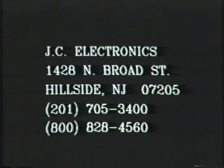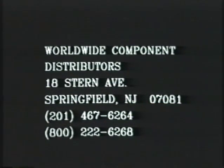One is the transistors themselves. The switching transistors are type 2SC3039. And for a while, I was paying $8 a piece for these transistors, but I've now found them for 90 cents a piece. The source where I get them is JC Electronics. The switching transistors can also be obtained from worldwide component distributors.